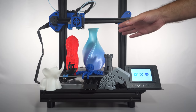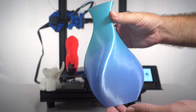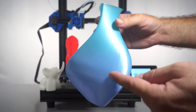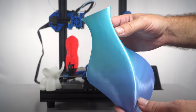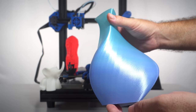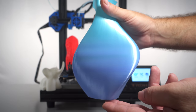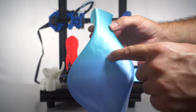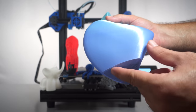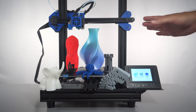For the last test I printed in spiralize mode — a vase in rainbow filament. It's a short print so we only got two colors: a nice blue transitioning to a lighter aqua teal. You can really see the layer pattern and the salmon-skin vibration effect from the stepper motors. Unfortunately I was a bit hasty removing it and broke the bottom — forgot how fragile a single-wall layer is. But the bonding and overall print quality is amazing.